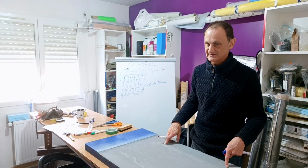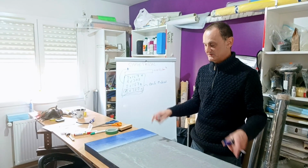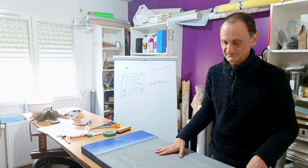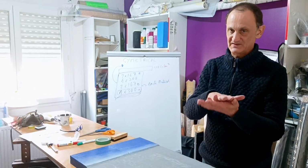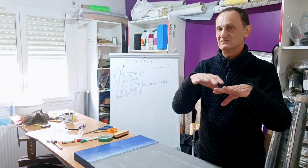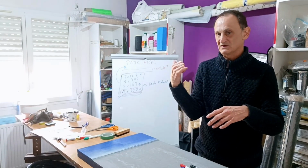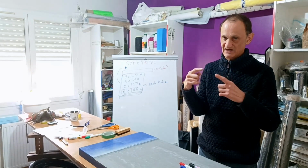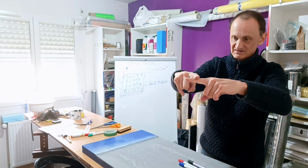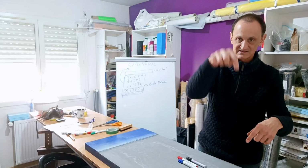Normally you will put light fiberglass or carbon. And this is because this is non-woven material and it will let less print through. I mean that the fibers are like this and not crossing each other. You have multiple layers that are stacked above each other, because the 167, the twill 2 by 2, means that there are two crossing on two on this side. Okay, two here and two here. So it's making like this all the time.